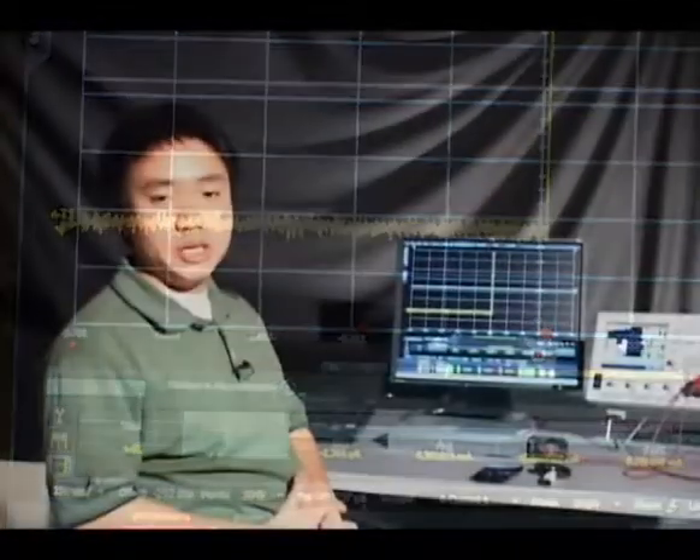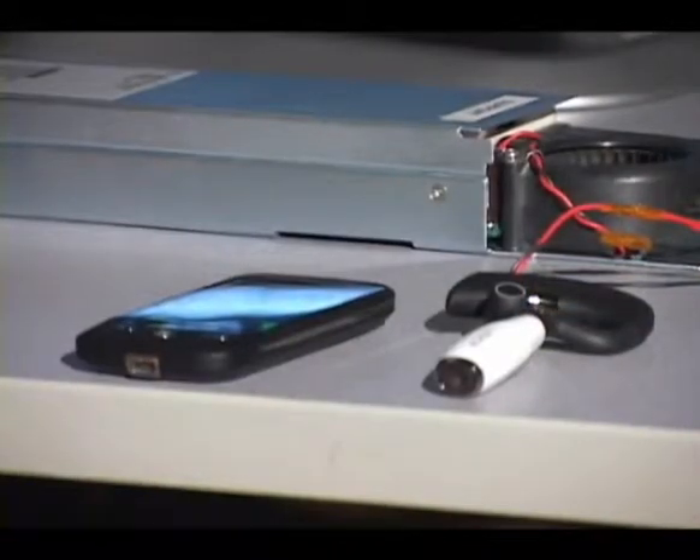So in summary, the seamless measurement ranging feature on the N6781A Source Measure Unit allows us to automatically and seamlessly choose the most accurate measurement range for our measured waveform. In the battery-powered device that we were using, the Bluetooth headset, the turn-on current ranged from microamps all the way to 60 milliamps. Using traditional techniques such as current shunts and fixed-range measurement, we're not able to capture that waveform in the most accurate fashion. But using the Agilent exclusive feature, seamless measurement ranging on the N6781A Source Measure Unit, that chooses the current range for us, and we're able to capture each portion of that waveform using the highest level of accuracy.